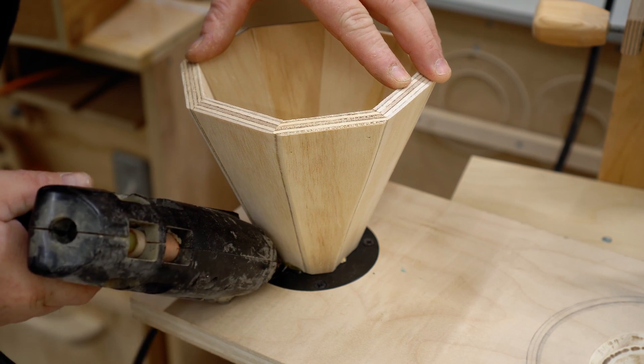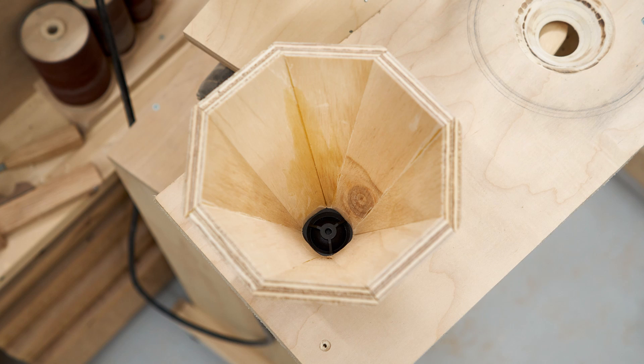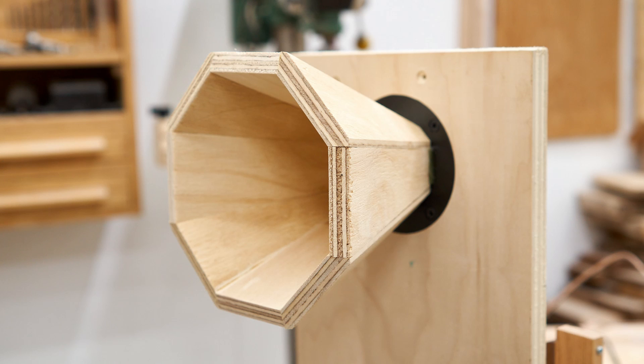When the glue dried, I sanded the outside. I really didn't need to do that since this is just a test, but I thought it would look better in the pictures. However, I do need to sand the end that goes up against the tweeter and make that really flat. To fasten it to the tweeter, I'm going to use hot melt glue. Here's what it looks like on the inside. I repositioned my mic so that it's exactly one meter from the outside edge of the horn, and you can see just how much higher the output is.